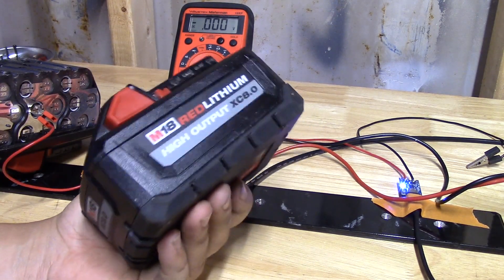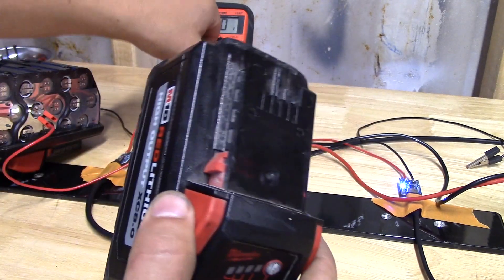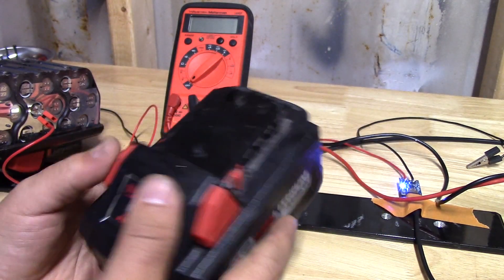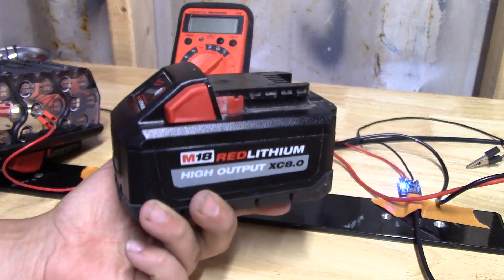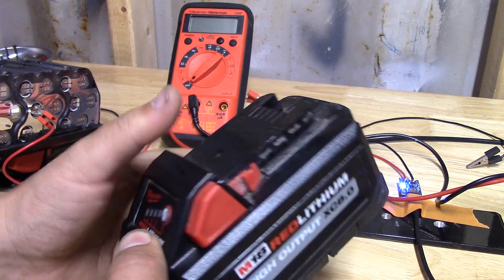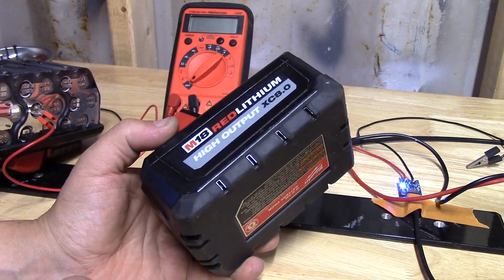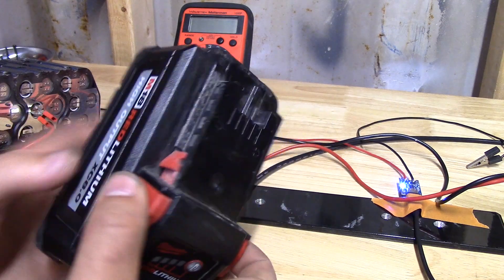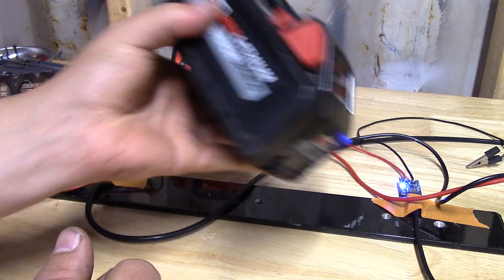The reason they went out of balance is because some cells have a higher internal resistance, meaning the quality of those cells is worse than others. In this pack, only one group was good — the rest were under four volts, so most of these are pretty bad. Hopefully they last another year or two. I'm also waiting for the Forge battery packs — the 8 amp hour tabless cells — because to properly maintain tabless cells you charge each group individually anyway, making cell imbalancing very unlikely. However, they're hard to get and a little overpriced.